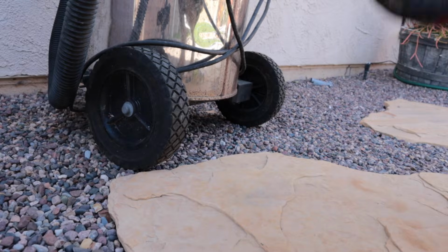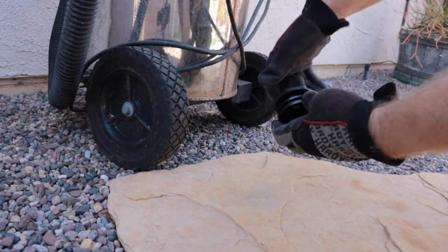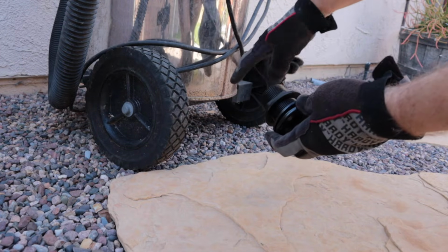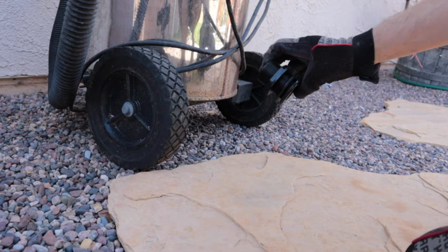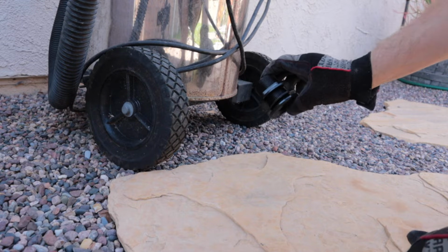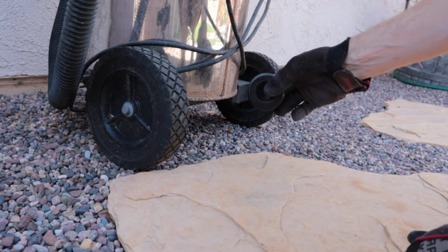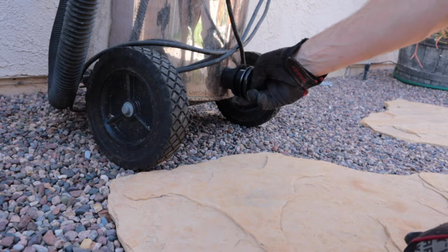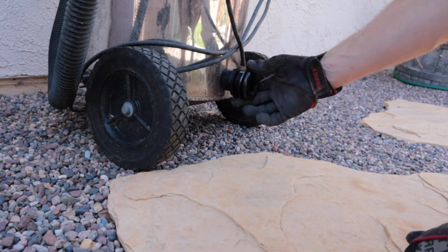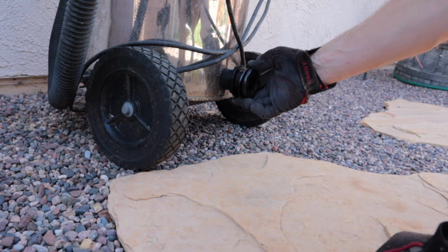So to set up the drain on this, we're going to use a bulkhead fitting, and a bulkhead fitting is a little piece here that sandwiches between here. It gives you a drain hole out the back. Now this was the only part that I couldn't find at my local hardware store. I did have to order this one online. I do have a link for it in the description below, but you may have luck finding this at a local hardware store or pool supply. So we're going to locate where we're going to put it right about there, because we do want that flange to sit nice. It won't be all the way at the bottom, but it'll be good enough.